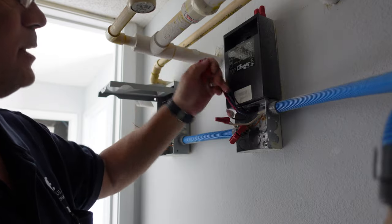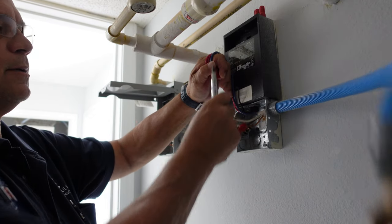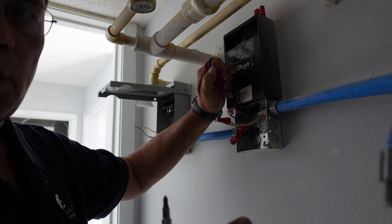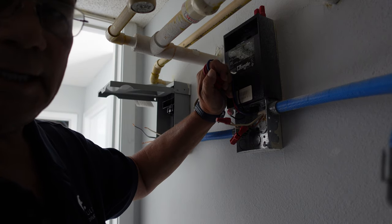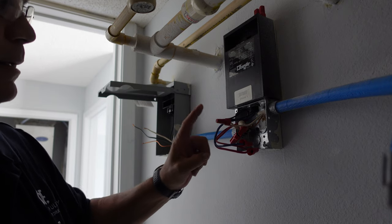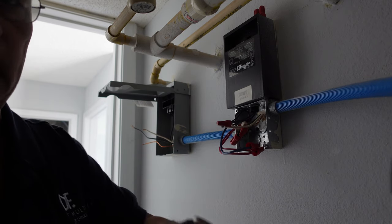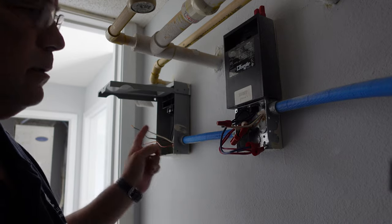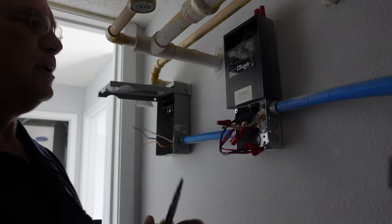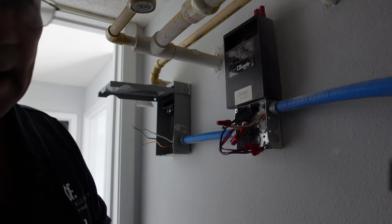This thing has already been bypassed. By putting a solid wire in here between the disconnect and the water heater, we're definitely going to make this better than having a connection at the disconnect, another connection here, and another connection at the water heater. We're just making the connection here and the connection there, doing away with this middle section - which is a lot better.